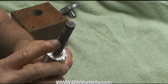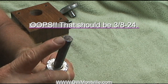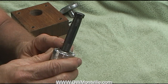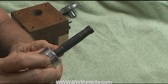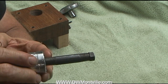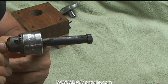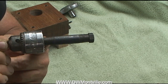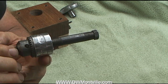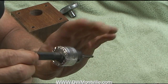The other end was threaded with a 3/8 by 32 threads-per-inch hole. I had a bolt threaded that way. You see this piece of pipe here — this is quarter-inch pipe, about two and a half inches long. When you put a chuck onto the bolt, you have to have something for it to tighten up against. You either use a shoulder bolt or, as I did here, just put a pipe as a long bushing to take up the gap so you have a place to drive it. You want to tighten it on really well because you're going to be using this in both directions.